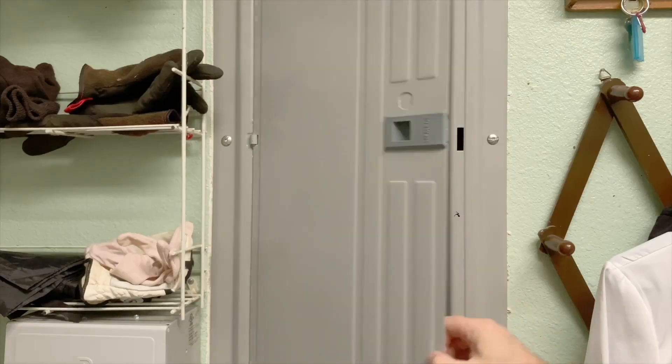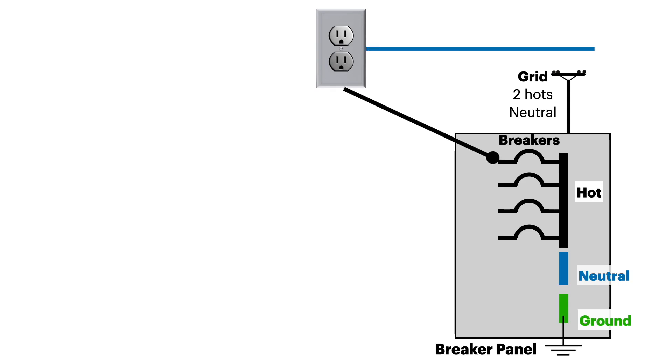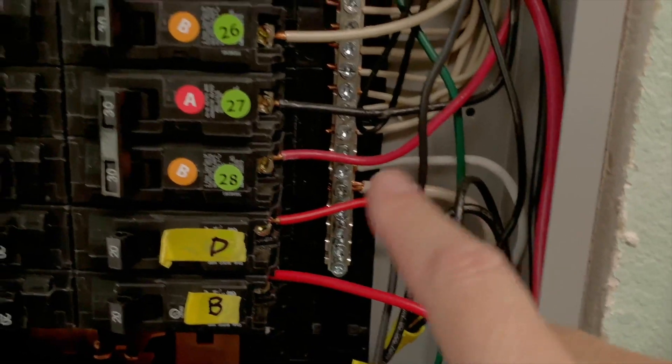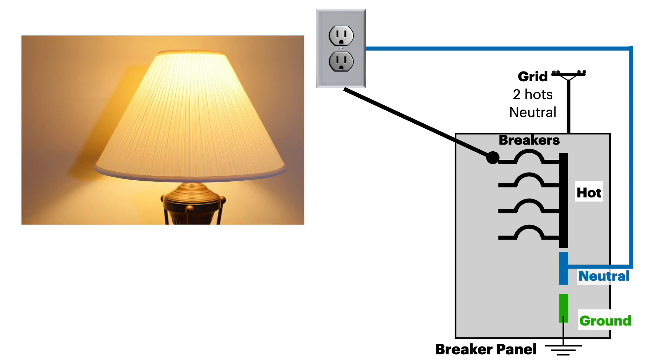Here's how you wire this up. We'll start with the main electrical panel in your house. Now let's look at a 120-volt circuit. For this we're only going to need one hot bus — this could be line 1 or line 2. This little symbol represents our breaker. The blue bar represents our neutral bus and this green bar represents our ground bus. To operate a circuit we take a hot wire from one of the breakers to the circuit, and a neutral wire returning back to the neutral bus bar. Here you can see all the white neutral cables going to the neutral bus bar — we've got a completed circuit.